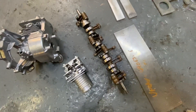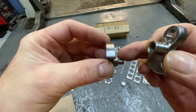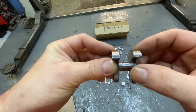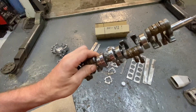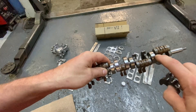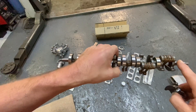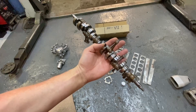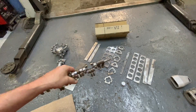Made the crank and then I had second thoughts about it. The crank is pressed together with the original crank being turned down to 7mm and then a press fit — it's pushed together like that with a bearing on there. But the problem is if one of these interference-fit joints slips, the whole engine is sort of scrapped because it all goes out of timing. The actual output at one end of the crank could make it slip on one of the joints to the other end if it backfires during starting or anything like that.